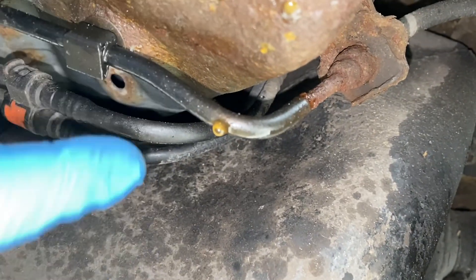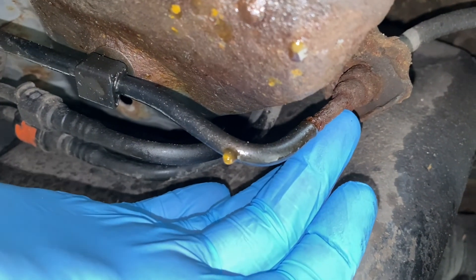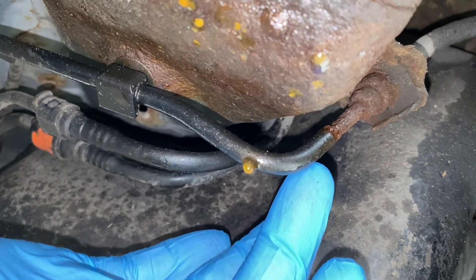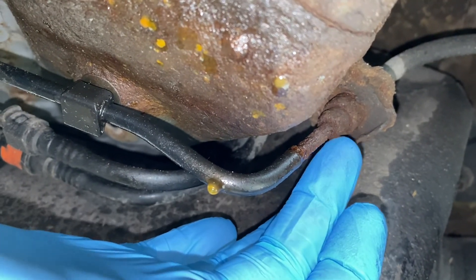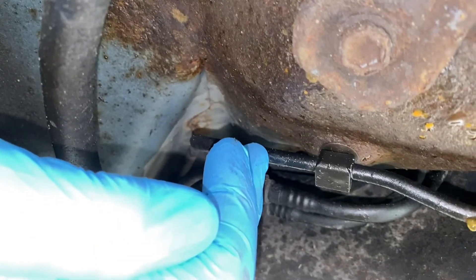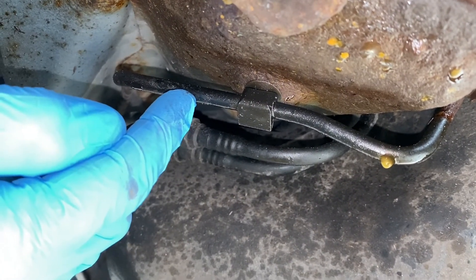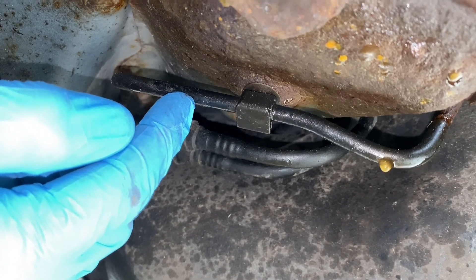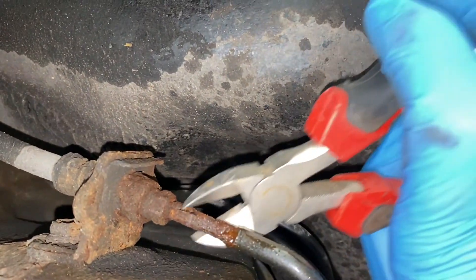What I'm going to be attempting to do — because I've never actually done this before with this type of brake pipe tool — is I'm going to be linking a piece of copper into that joint there. And then I'm going to join to the steel round here. I also forgot to bring a stanley knife to take the coating off, so that could be a bit of a problem. Let's just see how we get on.